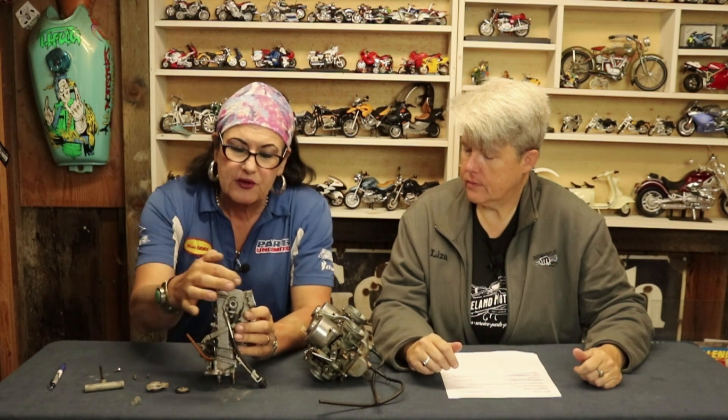We're going to have a look at some of the components of this carburetor. Most importantly, you can see what happens when you open the throttle. The throttle cable goes on here and turns this wheel. And when you turn the wheel, you can see that there's a slide that opens. The more you open the throttle, the more the slide opens, the more charge gets inside your engine.